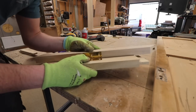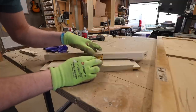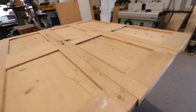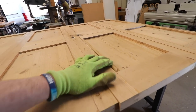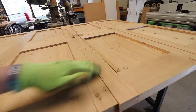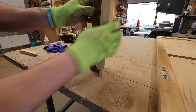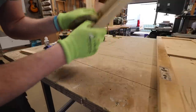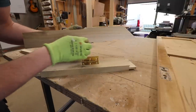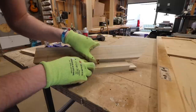So one thing I have noticed from doing this mock-up is I'm going to have to change that slightly, because the beading on these shutters sticks out ever so slightly in places. So like here, there's about 4 mm protrusion on this beading around the panel from the face of the shutter. So if I install it in this manner here, where we've got like a 2 mm gap between the frame and the shutter, when I open the shutter, the beading that sits on this outer edge is actually going to foul on the frame.